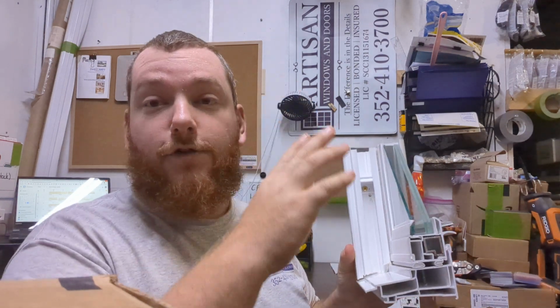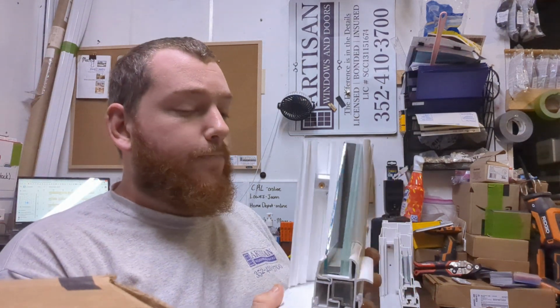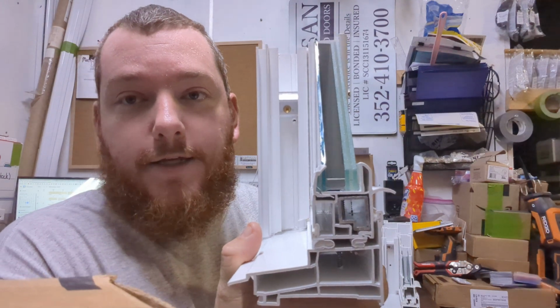One of the big things being wind, because if you're in an area where there's extremely high wind speeds and all of the windows get blown in, then the pressure envelope of the home is compromised, and it'll help the roof lift off the house, and then the whole house is totaled. So that's one of their primary design concerns, just to keep wind from being able to compromise it, even if the window glass is broken, just to hopefully keep the roof from lifting off the house. So you can see that's the primary two things structurally that make an impact window much stronger and a better fit in those areas where you've got really high wind speeds and high risk of hurricane damage.